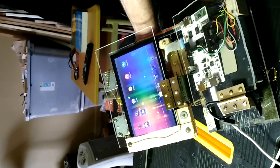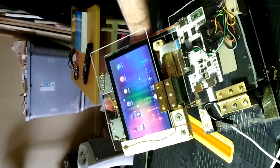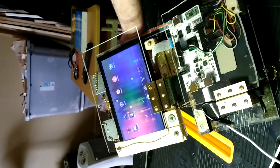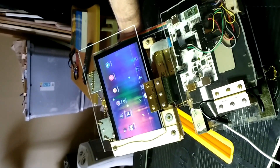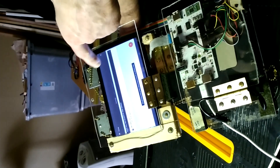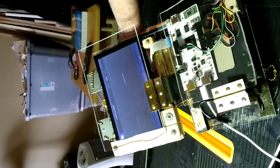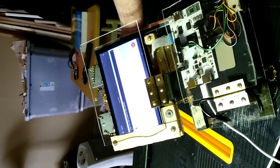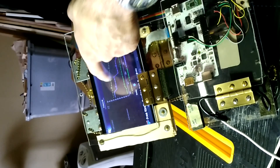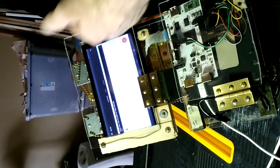Tasker should start up and basically it starts up cycling between weather and the bus schedule. I tried to get an Android operating system version with LVDS touch screen support on a bootable SD card, but there were none available. In Linux you have the option to back up or create a bootable SD card using DD commands, but I couldn't get that to work in Android. I spent quite a bit of time trying different methods, cloning it back in Linux. If anyone has an idea how to do that, I'd like to have this on an SD card — this is the second time I've had to reinstall Android and rewrite my script.